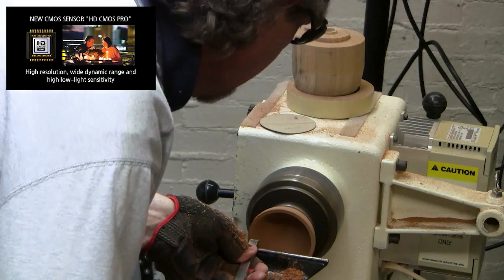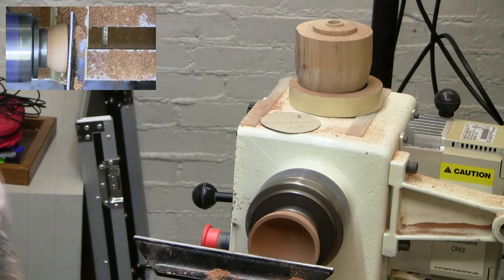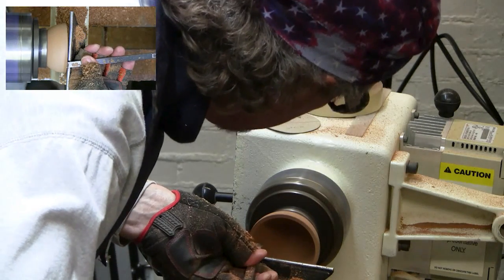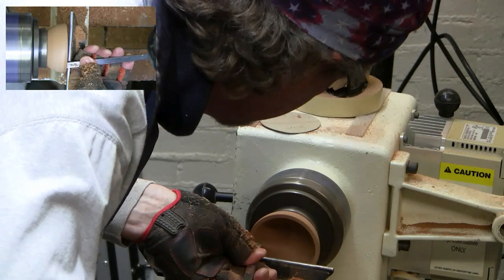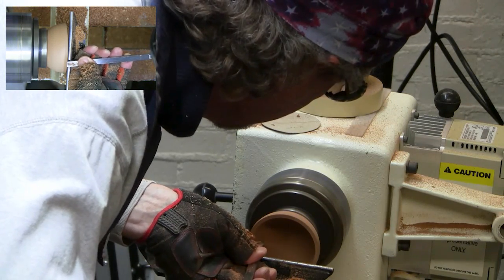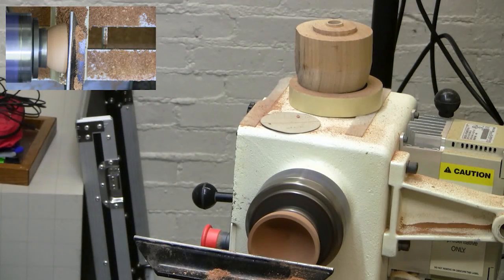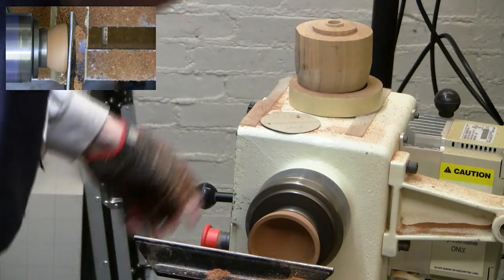One other thing you want to do is make sure that the top little bit has got straight shoulders. I didn't bring my bedan tool. That's what I would normally use to make that with. But that top, you're going to put a tenon into there, so that needs to be straight to fit the tenon. You don't have to, but if you don't, the tenon has to taper to fit the curve that is the box. So sometimes I just go in and make that straight.